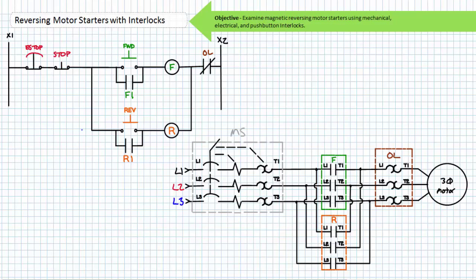Notice while in its natural deactivated closed state, the maintained contact e-stop in no way shape or form affects functionality of the system. When an operator presses and releases forward, the motor spins clockwise. When an operator presses and releases stop, the motor stops ready to initiate another start cycle. When an operator presses and releases reverse, the motor spins counterclockwise. If however, an operator were to observe an unsafe scenario, by hitting the maintained e-stop, the motor would stop and the system would be disabled. Importantly, due to the maintained rather than momentary nature of the e-stop, the system will remain disabled until the e-stop is reset. Neither the forward nor the reverse button will energize either contactor coil, and as such, the primary contacts will not close despite repeated attempts to do so. The maintained e-stop has disabled the system. Only after the e-stop has been reset and returned to the closed position can the system start the motor.